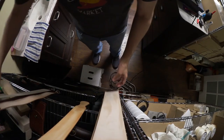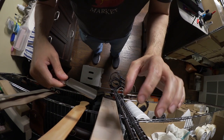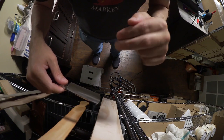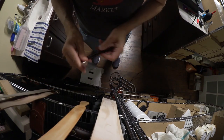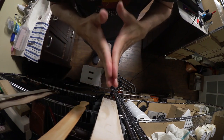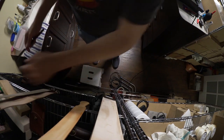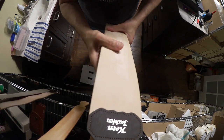Well, I wish you could see what I see, guys. The razor, when you look at it at about 25 times magnification with the binoscope, you can literally see the bevel getting thinner and thinner and thinner, and then a thicker line right at the edge, because what happened was the bevel was actually longer, and then you took your flat stone and reduced the width of the razor and made the tip, instead of coming together like that, it's got a little thing like this on the front of it. Now, it can only take from metal that was previously shaped like that, but you're still stunting it off a little bit, and you will see it looks like all the light comes together right at the edge. However, because the whole thing is so thin, I would imagine it strops better, and I'm convinced it will shave better. Let's see if we could hear anything different on the strop.